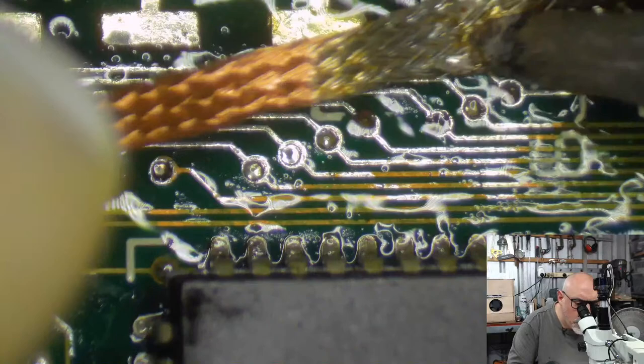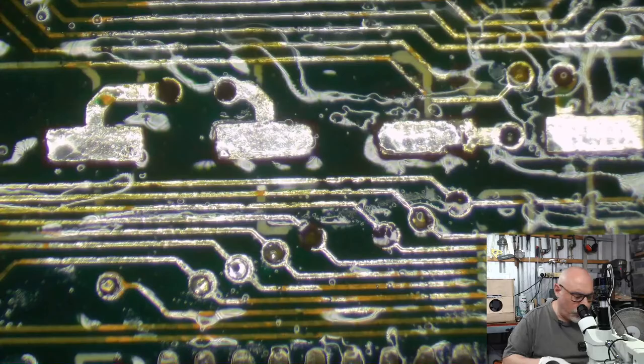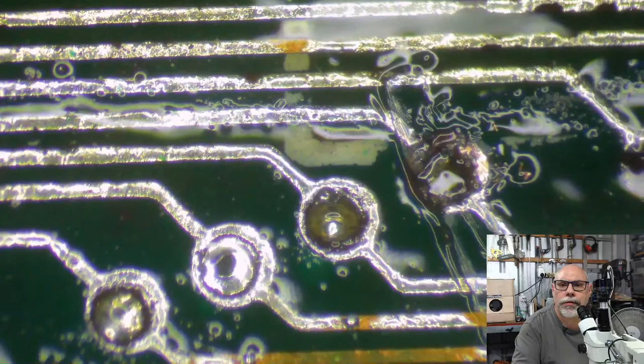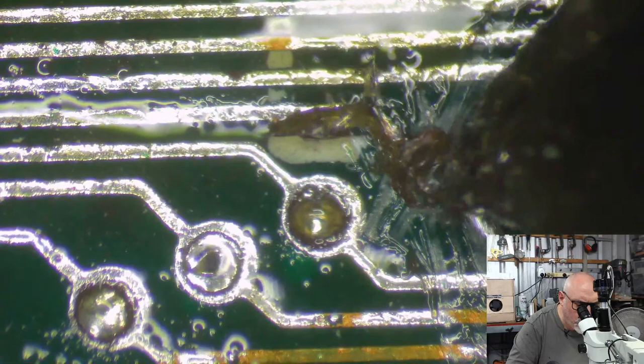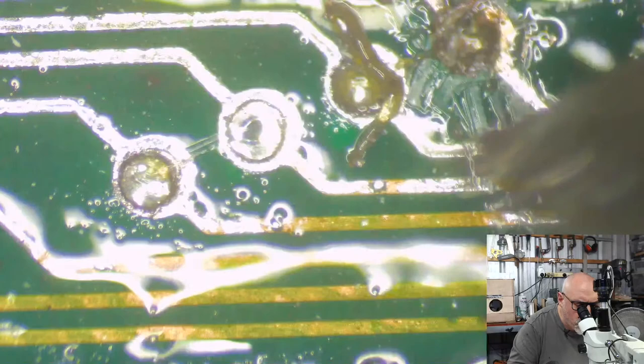Well, we're starting to look a little bit better here. It's nothing awesome, but it's looking okay. I've got to sort this little bit of yuck out here. I don't know if that's broken or not. Let's go down and have a look. Zoomy zoom. Yeah, that doesn't look too crash hot, does it? Does not look too crash hot at all. Nope. Might come at that from the other side. I'm going to probably try and suck out the solder from these. I just think it will be more advantageous. Okay, so that's this little row of guys here. This is the other side of the board, as you can see. Well, no, you can't see because it's out of focus. You see, it looks a hell of a lot better from this side.